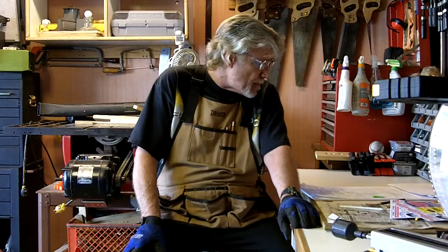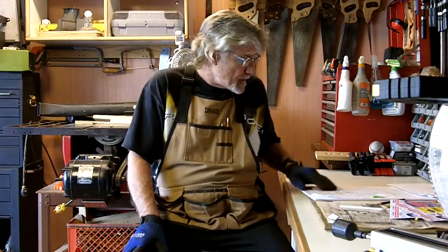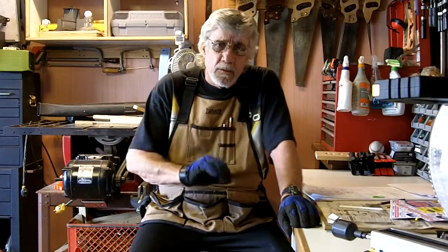But I'm getting down. Since last time I spoke, I've built 3 new cabinets. I've done it the same way as I always had. I used the color pencils, blue, black, red, green for the different lengths of melamine board, and cut everything out one day and dado it the next, and on I go.